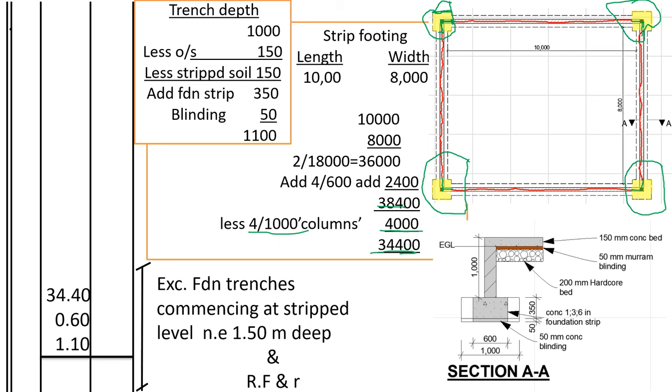So it shall be 34.40. We multiply by the width of the trench, which is 0.60. And then we multiply by the depth of the trench. Now, what is the depth of the trench that we shall excavate? If we come to the section AA,